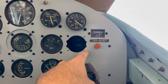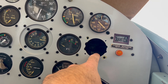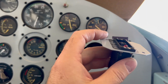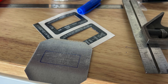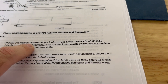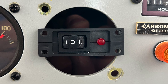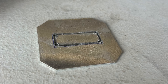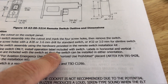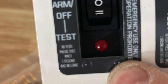I had this hole on the panel where the old switch was mounted. Originally I thought the switch would just mount to the back of that hole, but it's an odd size — not your standard 2.25 inch, it's a 2-inch hole for some of these old military gauges. Because of the placard that came with the switch, I ended up making a plate to cover the hole from the front. The ELT must be installed using a two-wire switch — there's a standard switch or a slimline switch option. I went with the slimline switch to take up less panel space: mark the cutout, fit the switch, mark screw holes, drill, and install. I started with the horizontal label orientation and messed that up, so now I'm going with the vertical.